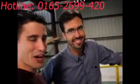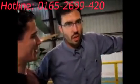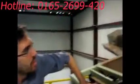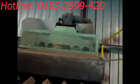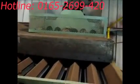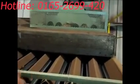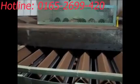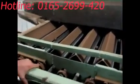After the walnuts are hauled, they go to a sheller, and my friend Bruce here is going to show us how they're shelled. Tell us about these machines here. Well, I run this big walnut cracker here, and the walnuts start at the top. They come in from the outside, from the haulers, and come through this elevator down under this sizer deck. From here, they're sized. The small ones will go that way, which I'll show you in a minute. The bigger ones fall through to these crackers right here.